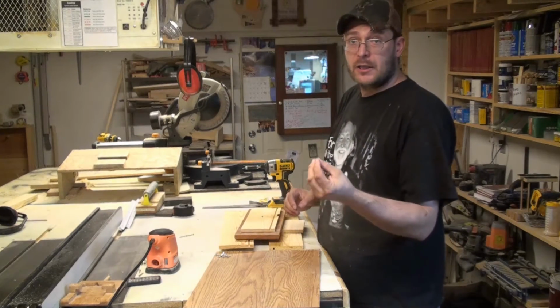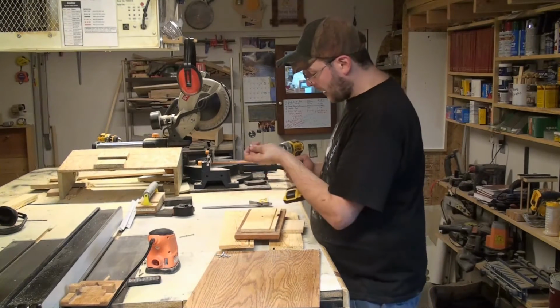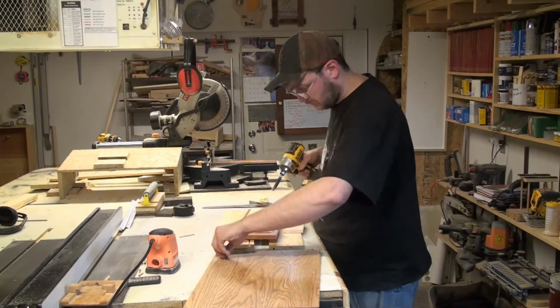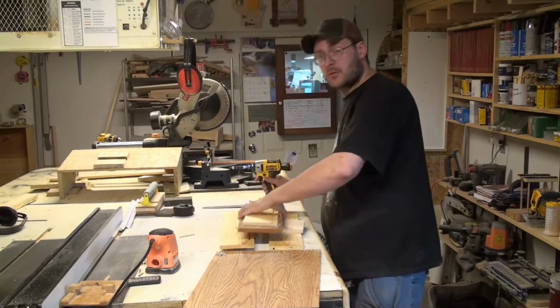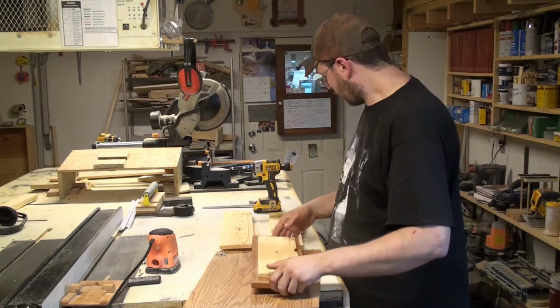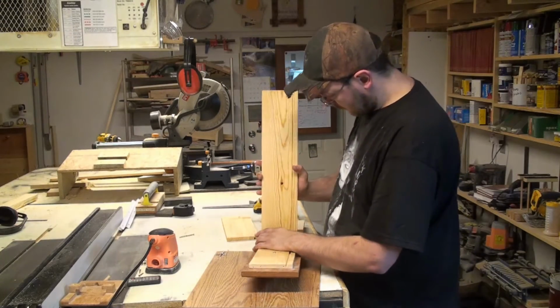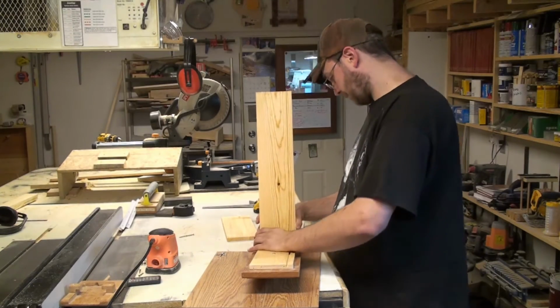Could use some 3/4 inch long screws. Screw this onto your face frame. Pretty much going with 4 screws. Okay. Now 20-inch long boards. I'm going to go in there like this. Just going to screw them right on.